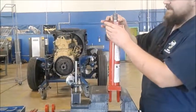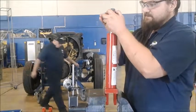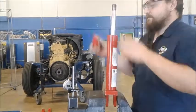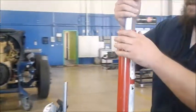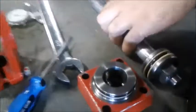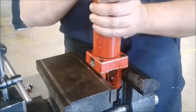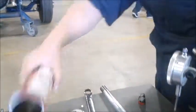So with that, take off the restraining bolts and the top yoke. Go ahead and just gently lift up on the top head. Comes off just so. Now these are very carefully machined parts, so you do want to be careful not to ding or scratch them. Set them on a clean area so the internal parts are not contaminated. And that's all you have to it for the disassembly.